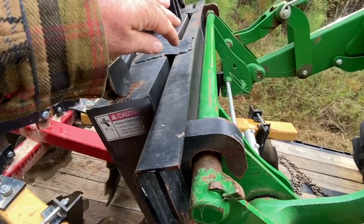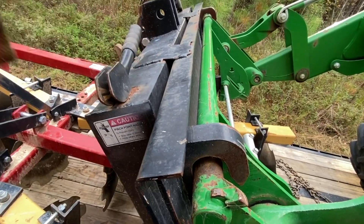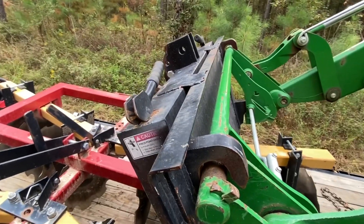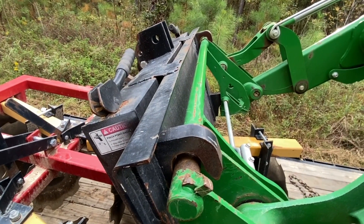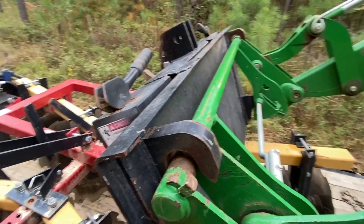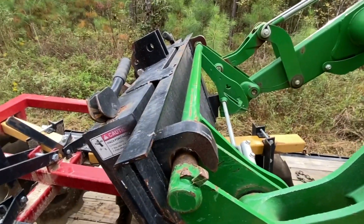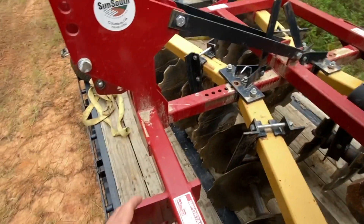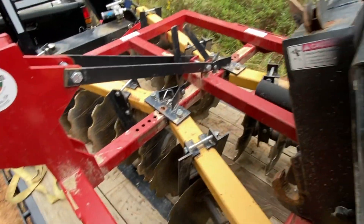This bending is being caused by the weight of the object on the front wanting to bounce up and down. Out at the base, them old tank trails we run down are pretty rough — they get washboarded real bad. If you've got the cedar on there, that's 2,600 pounds, which is a pretty good bit of leverage. Same with this disc: if you're hooking on here and you've got that disc out there, it's a lot of leverage.